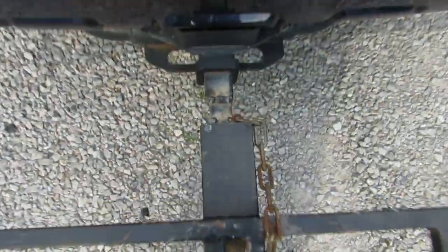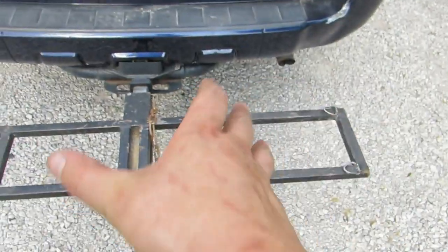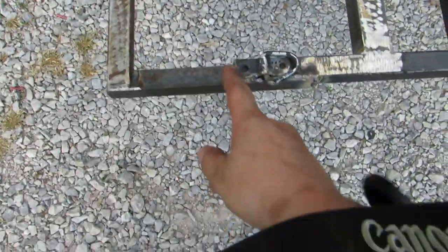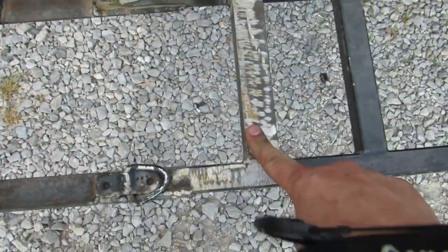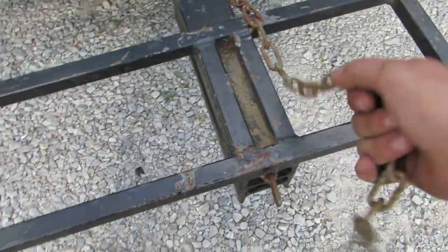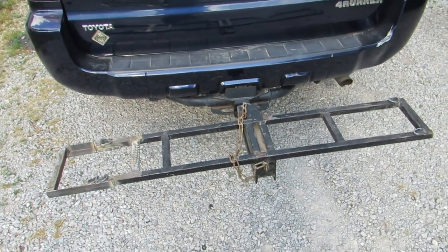Alright, we're back. Went ahead and fully welded all these joints — where the one-inch goes into the one-and-a-half, then into the two, and that goes into my hitch. I wound up not cutting the back off because the way that bike is set up, the engine sits right here and the back tire is there. So I just added four inches to the front — that's really all it needed. I cut the bar out, took a little two-inch angle iron, welded them on, welded a new bar at the end, and put a little piece of angle iron so the front tire sits in and the back tire sits in, then straps. The chain here is for safety and anti-theft — you can run it through the frame and hook it up, and that'll keep the bike from tipping over if one of the straps fails.